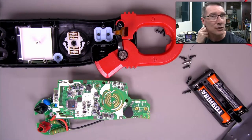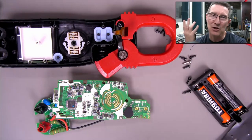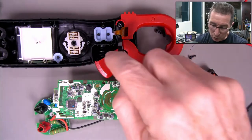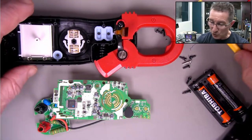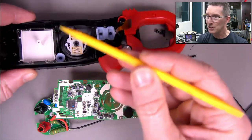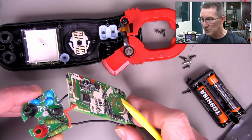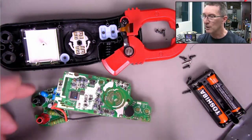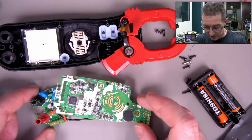This is a hall effect sensor - yes, it is a DC one. They offered me an AC-only version but no - I want DC as well because a huge part of the market is the solar and battery world, which is all DC. This is true RMS AC and DC. The case feels good quality with deep blast protection and really good input protection - three MOVs, a couple of PTCs and two fusible resistors on a separate board. That's how they get their high CAT rating.